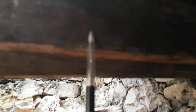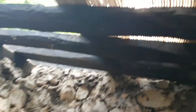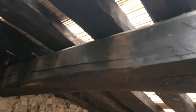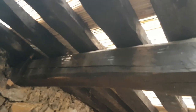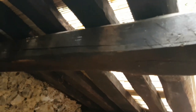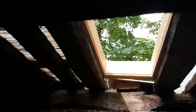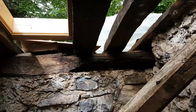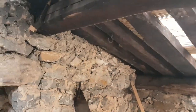Old wood is always stronger. If it hasn't got dry rot, if it hasn't got termites or something, and it's sound, it's always stronger than anything — because today you're really going to be buying pine. Back in the day they had plenty of old wood, so they used the best stuff. This is chestnut, for example — you might find oak or juniper. Those woods are so strong, so tough, and pine is nowhere near going to last as long. So you're trying to assess which bits of wood are solid and which bits aren't. The bits that aren't, you replace and repair. You save yourself a lot of money by just taking that step a little bit carefully.